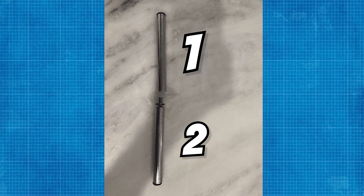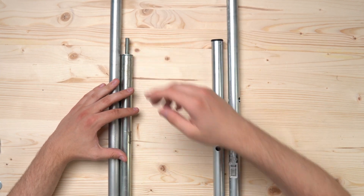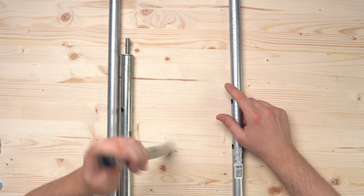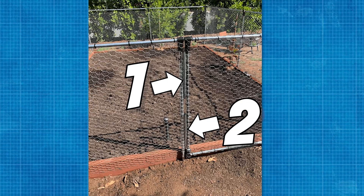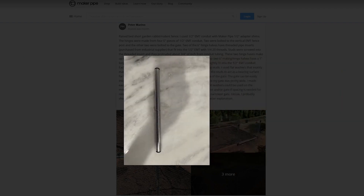This next hinge is really cool because it allows you to remove the gate that the hinge is attached to. Peter made this when he wanted to be able to take the gate off his garden enclosure, and he achieved it by making the hinge in two pieces. There are two pipes with holes drilled out to connect to the structure, plus a threaded pipe insert and a bolt or stud coming out of the top — that makes up the part that attaches to the structure. The piece that attaches to the gate also has two holes drilled through it, and the bottom part has an end cap or shim with a hole big enough to fit over the stud from the structure piece. You slide the gate side over the stud, giving you a gate that opens and closes. You do need two hinges per gate to keep it rigid. I'll link Peter's post in the community down below so you can see his write-up and pictures of all the hardware.